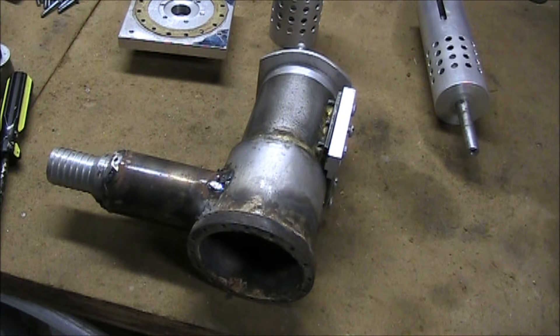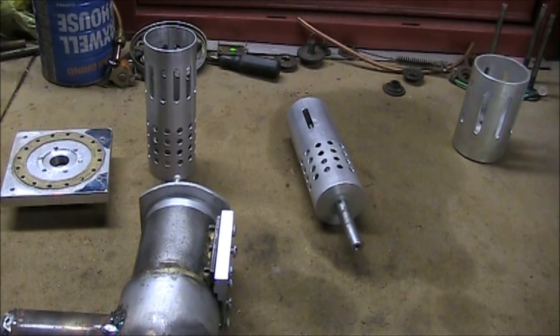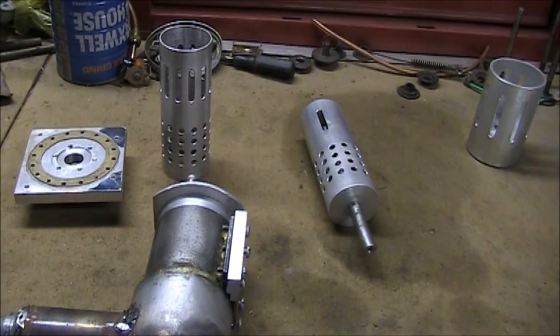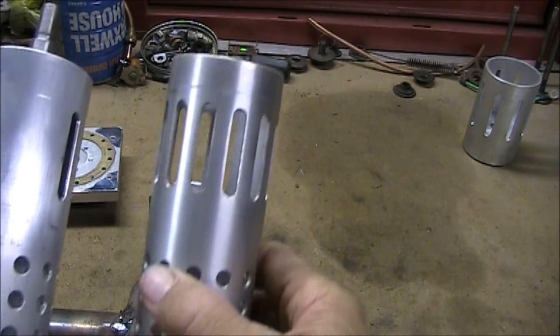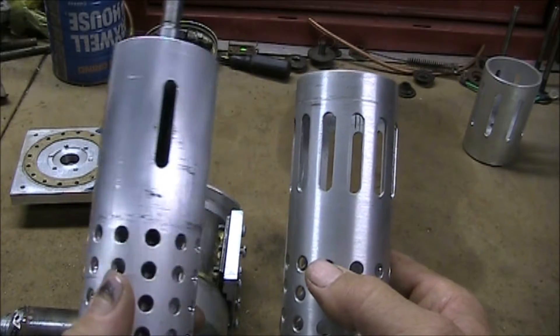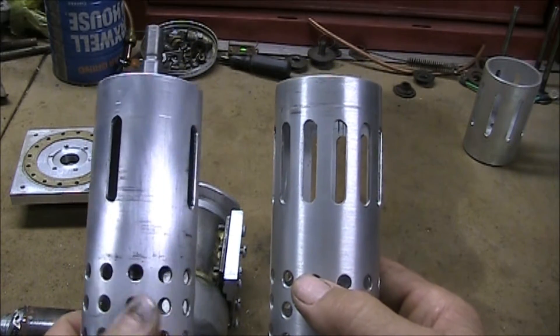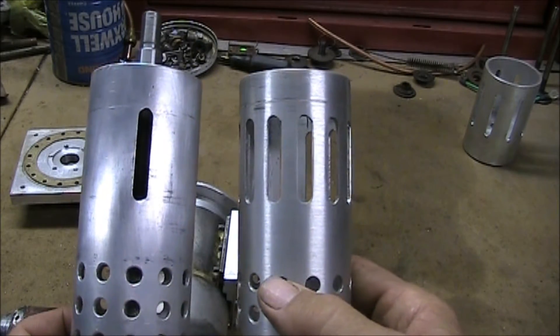I put together this air chopper rotor assembly as a prototype for a high pressure air siren. You start small and see what works and what doesn't work. What did work was this rotor with more dead time — that lets the horn resonator work better.